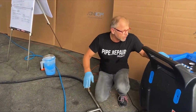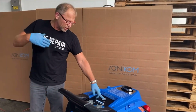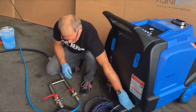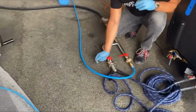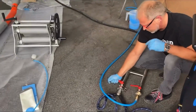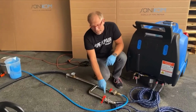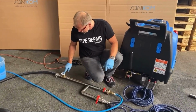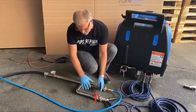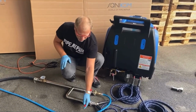So I have heard it was switching off, okay, because we reached already the complete pressure. It is heating up completely. So then I open here, and then I slowly open here. As soon as I open here a little bit, I can see already how the temperature increases. Always take care when you regulate here that your curing pressure is not going too high.